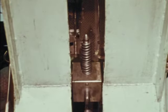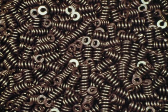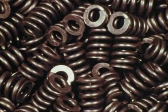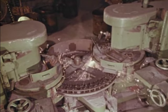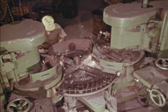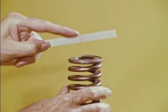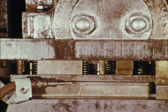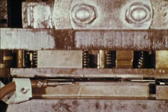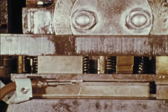Every Raymond die spring is sent through two remove-set operations. This assures you that these springs, used within their recommended limits, will not fail in operation because of taking set. Both ends of each Raymond spring are ground to provide a reliable, flat, maximum bearing surface, which permits the spring to compress evenly throughout its length. The result is uniform load and stress values in each spring coil. Each is doing its full share, and high-stress concentrations are not being built up in any single coil — another reason for Raymond spring's longer life and better performance.